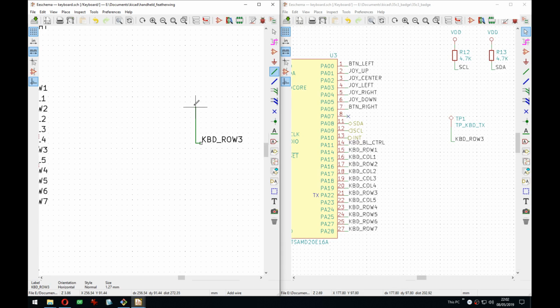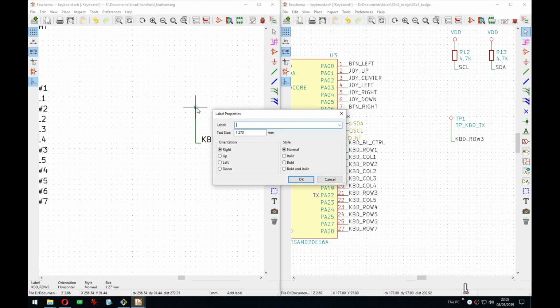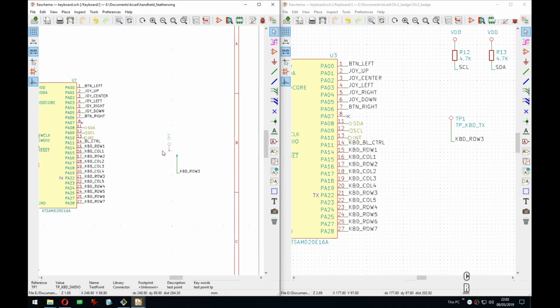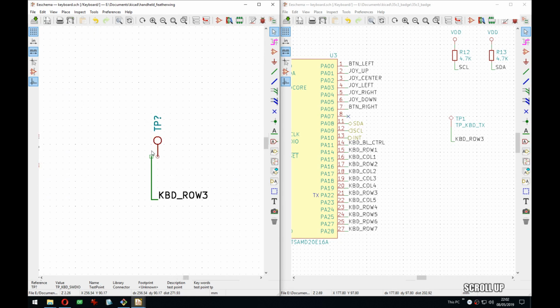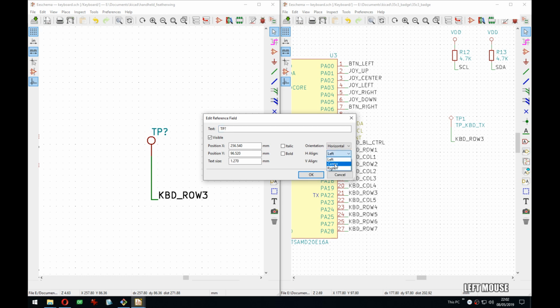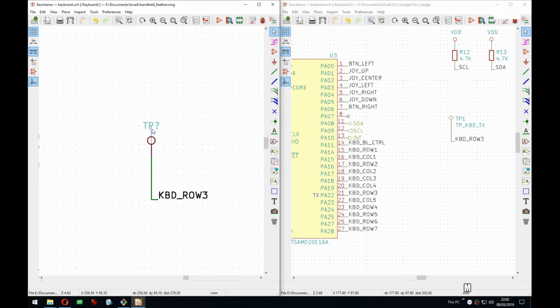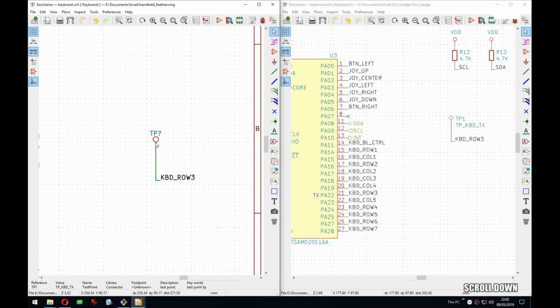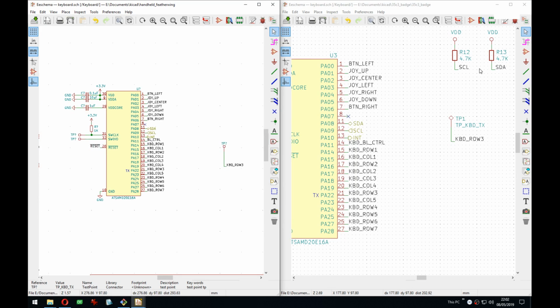Copy this one, we put a test point on it. Not a label, a test point, so I copy again. I hope this copying doesn't screw me over because something might get preserved. TX. All right, and then we need pull-up on I2C since it seems the feathers don't have those.